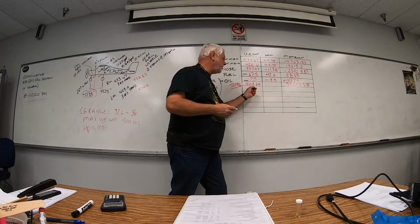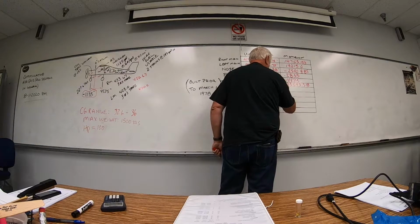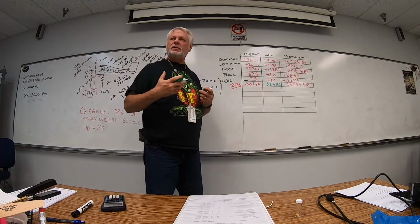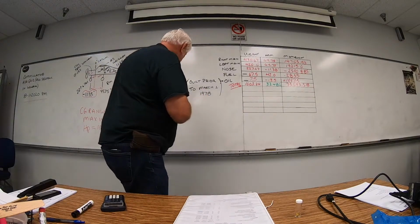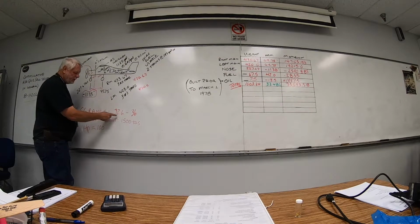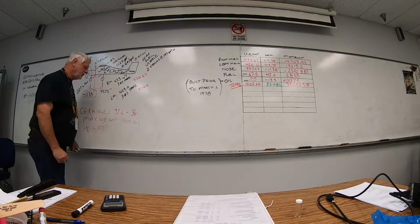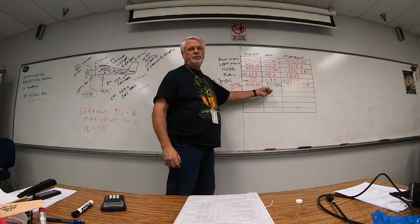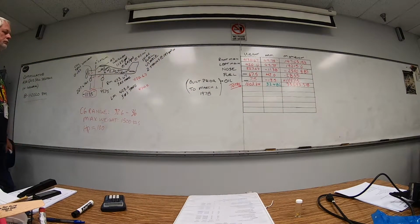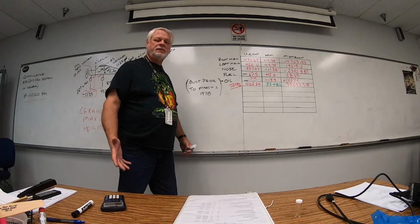Should be that divided by that, right? 33.482. And typically to tenths is okay. Now, I looked up the type certificate data sheet earlier, TCDS, and I established, based on the information on the TCDS, that our CG range was 32.6 to 36 inches. We fall within the CG. We are legal to fly that aircraft. Good to go. Hopefully that makes sense.